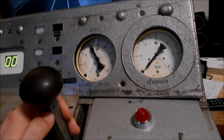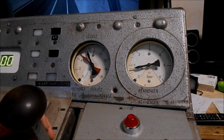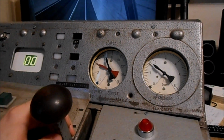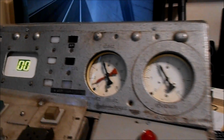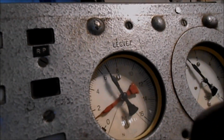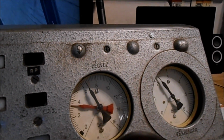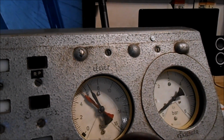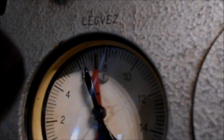Let's first see the brakes. Now it's in closed state. And with full braking, so this way the brake line is emptied fully. At charging it releases slowly. At first fast release, of course, it can overcharge the brake line from the main line.